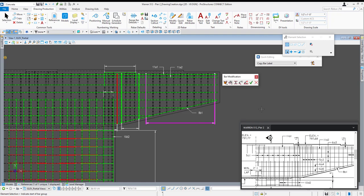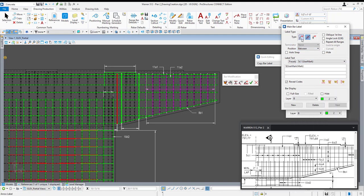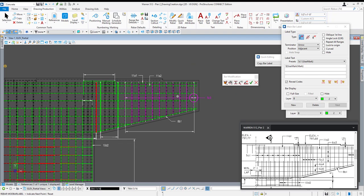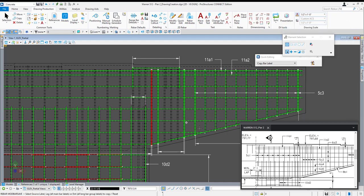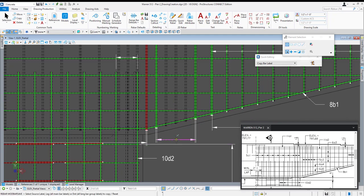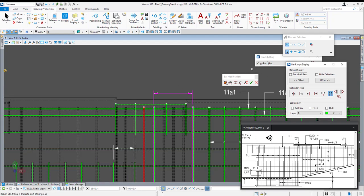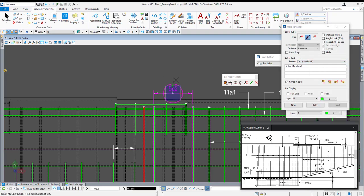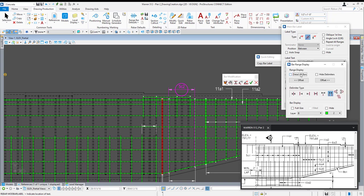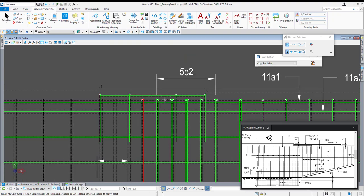Now for our stirrups: modify rebar, detail all. I'm going to do the internal as I want to point to them there, and go ahead and label main with our user mark — on an arrow, adjacent, lock to origin turned off. Click and 5C3 — perfect. I'm going to accept that, then modify these next and hide that delimiter, detail all, and accept. Now for my 5C2s, I could call them out like this, but I'm actually going to switch it up a little bit and flip this to the other side, then use my label — line label callout to place 5C2 right there. Lastly detail all — I'm going to keep that delimiter. For the other set I'll detail all and hide delimiters, not bothering with labeling them as they're called out right here.